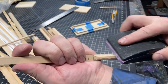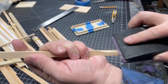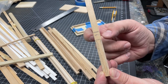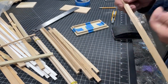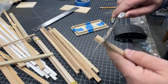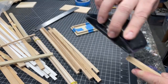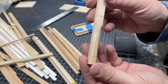Okay. Then you can take a sanding block and follow that same face you just created. Same thing here. And there is one side of your table leg. Your tabletop would be here, the skirt would be here, you'd have this nice structure, and then it would taper down. You can do that as dramatic or as small as you want. If you're really fancy, you can cut notches into it. And there you go. There's a simple tapered table leg with a little detail.